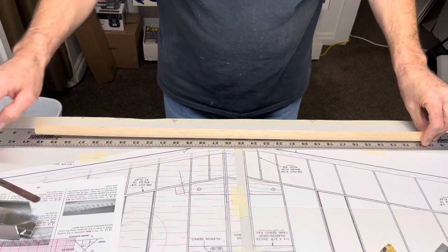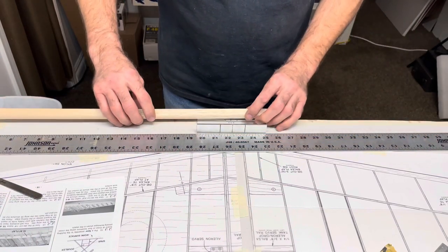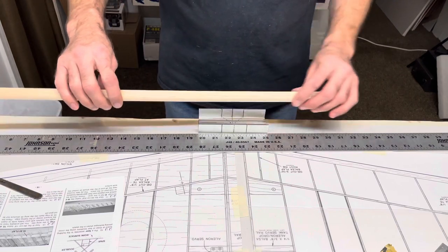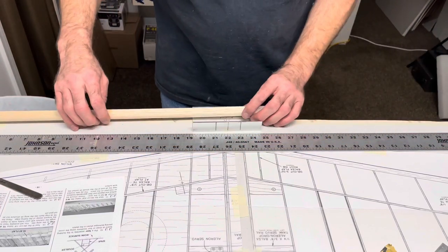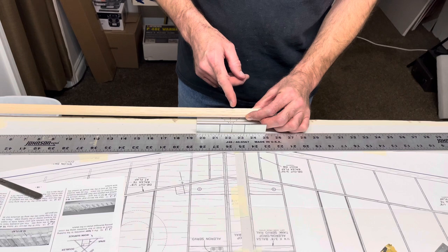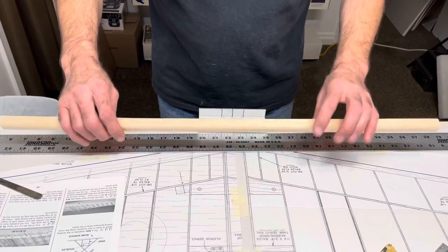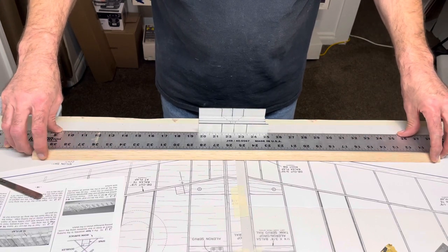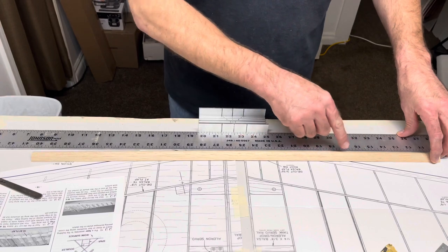So my idea is to take my miter box and just hold my leading edge like that, cut slits. Because it's a gradual curve throughout the entire length, I'm going to cut slits equally, like every, off the C. I'm going to try like every 4 inches maybe. Just move it down 4, and then I will force that straight, because you'll see how it's stretching it. I'll force that straight and wick CA in each cut.